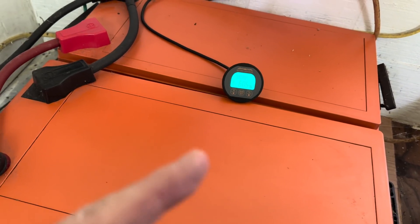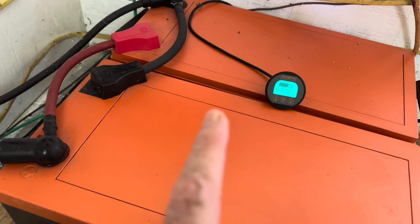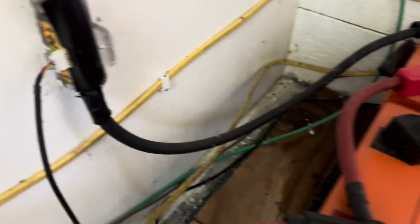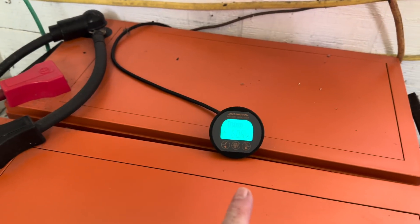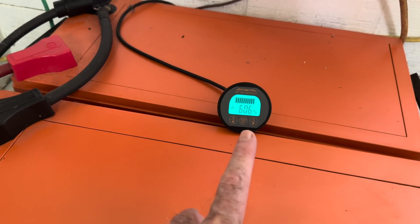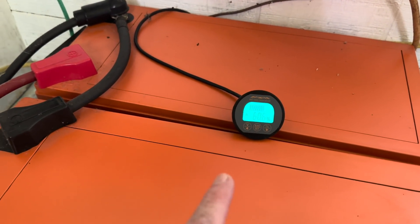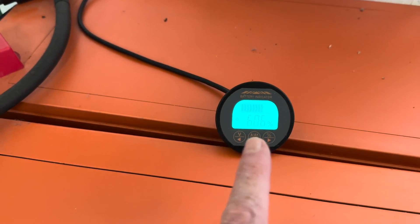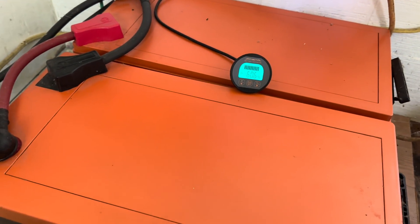The only thing I've really added to these is a shunt — it's not really necessary and doesn't affect usage whatsoever, but I put in a shunt. Here's the shunt. I could have a real good indicator of state of charge. I could look at the Victron app, but we know we don't want to chase voltage around to know your true state of charge. So on most of my systems I did add the shunt, so I could look and see — like, this one's 60-some percent full and charging. That way, just at a glance, I always know what my battery banks are looking like.